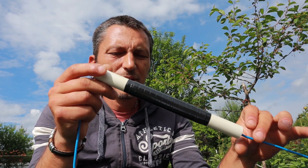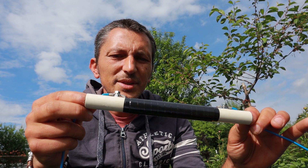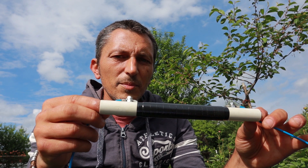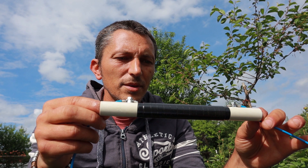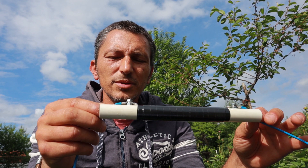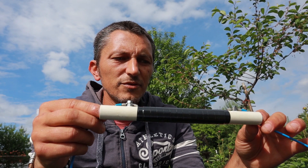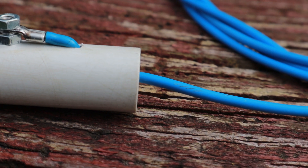Then I have a coil — I'm going to show you details of the coil in a little bit. This one is made out of 0.6mm enamel copper wire. The number of turns, specifically for the one that I built on a 20mm diameter PVC pipe, is 195 turns. Here you have a little detail about how I tied the cable.